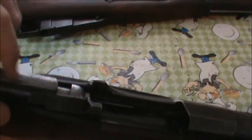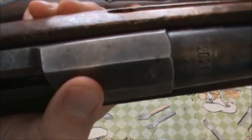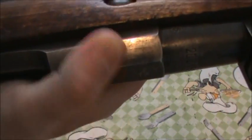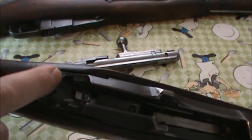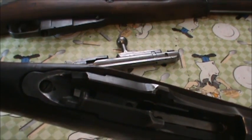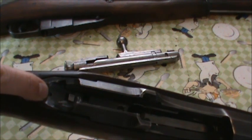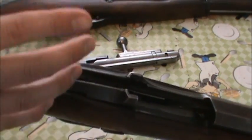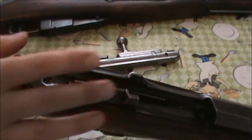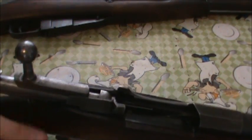This next one is a 1915 Tula. You can see the surfaces look scratched and rough. She's not terribly hard — probably heat treated adequately — you can see where the cocking piece was hitting it and peening it. They put a punch there to try to keep the screw from backing out. She's dimensionally good, just a little bit rough, but they needed guns in the First World War and were losing them at a pretty crazy rate.